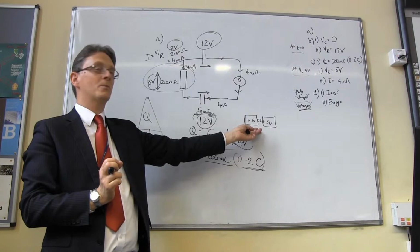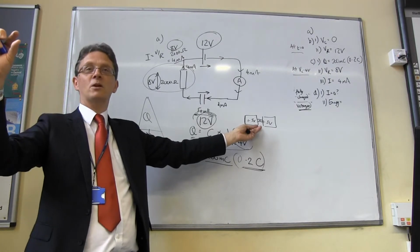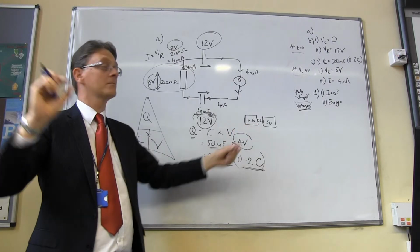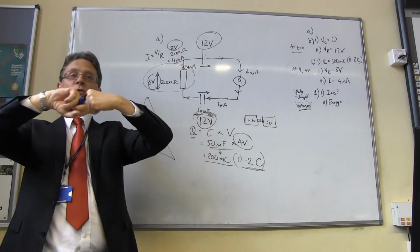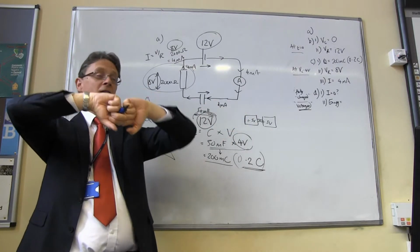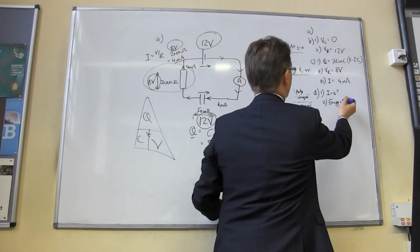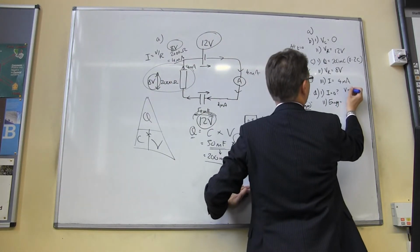Seen those ones? Take the battery out the back, turn one of the batteries round and put it back in. What will the torch do when you put that inside it? Won't work. How much voltage is the bulb at the end getting? 0. So think of it like 2 torch batteries connected the wrong way around. All that will happen is they'll get warm, the bulb will get nothing, and nothing else will move in the circuit.